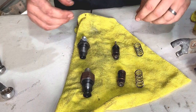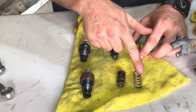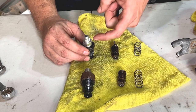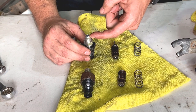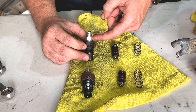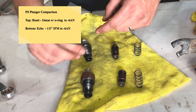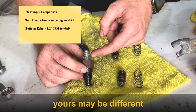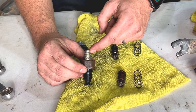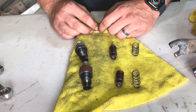The Echo is more available in the salvage yard so we decided to go with it. Instead of having the Hemi assembly in the Hemi power steering pump, we're going to completely replace it with the Echo internals. One thing to note: on the Hemi power steering pump we use an adapter to go to a dash-6 braided Teflon-lined hose - this is a 16mm o-ring to dash-6 AN. On your Echo you're going to need an inverted flare - I believe it's a half-inch inverted flare to dash-6 AN. So it's a different adapter fitting, but that's all you need to take away from this.